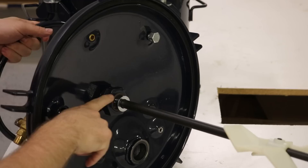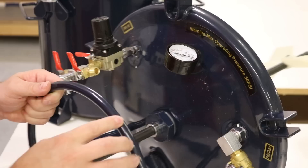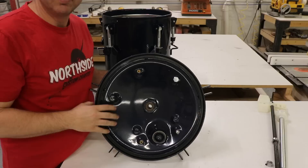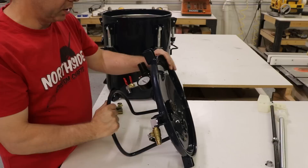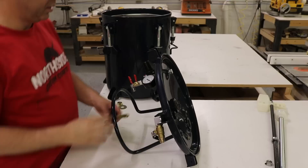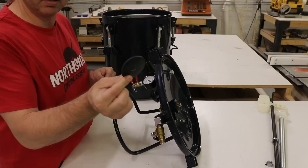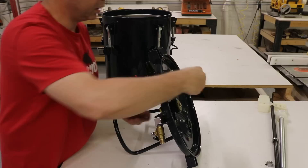One down. This piece here has a collar right there and a collar right here, and that small Allen wrench I mentioned earlier is going to go in there and we're going to take it off. Now we've made a huge hole right here by taking that rod out — both sides — this is a big hole. Our 5/8-inch bolts that we talked about earlier are what we're going to use. We have our bolt, and you put a metal washer and then a rubber washer on it in that order, then put it right through the top where we made that hole. We do the other side opposite: rubber washer first, then metal washer, then put the nut on.